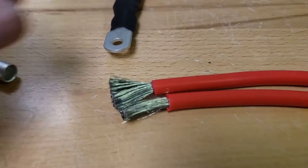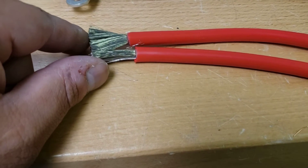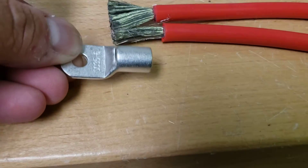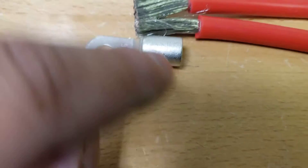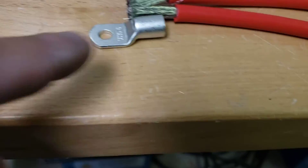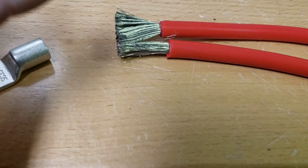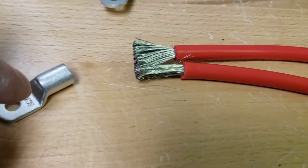It does fit, you just have to be a little careful. The first thing you want to do is use a wire stripper and strip a little more than the actual barrel. So you're going to have a little bit of a gap. You do not want to twist these together. What you're going to do is basically crimp these together as close as you can and insert it.